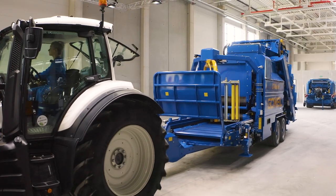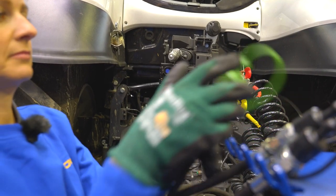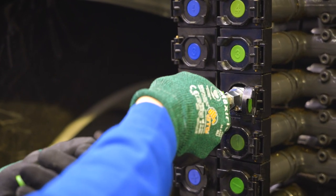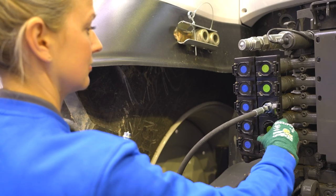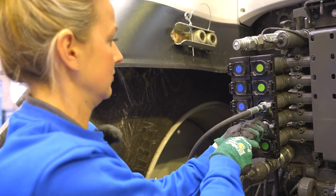Next, I'm going to show you how to maneuver it into its work position. Ensure that the machine is set up on a dry, firm and level surface. Two hydraulic control devices are needed in order to position the baler-wrapper combination. For the safety bolt of the pivoting drawbar, the hydraulic hose with the green dust cover cap is connected to a control device. The machine is positioned to the left or right using the hoses with the black dust cover caps — a double-acting control device is required.